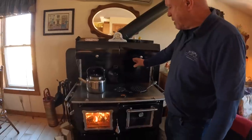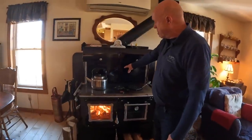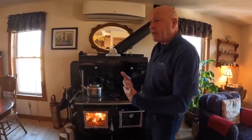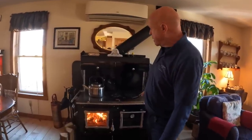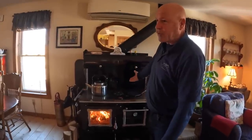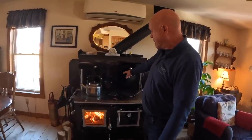It has an aluminum magnesium base, and it has a little tiny electrical motor in the middle, and there's some sort of strips inside that make contact from heat. So there's no electrical to it. All it is, it works off the fact that the base becomes very hot, makes the connection, and the fan starts rotating. The fan won't start until it reaches about 80 degrees.